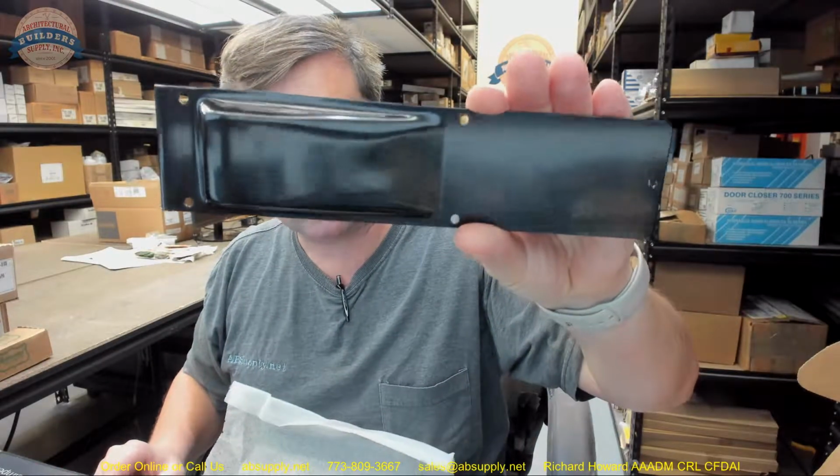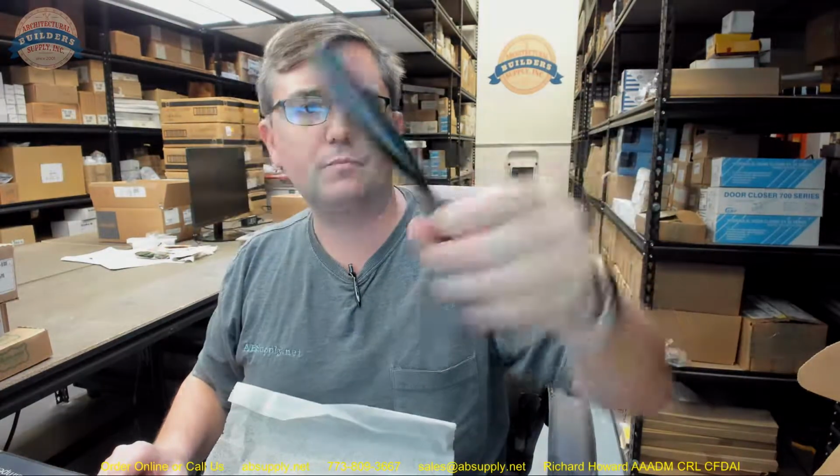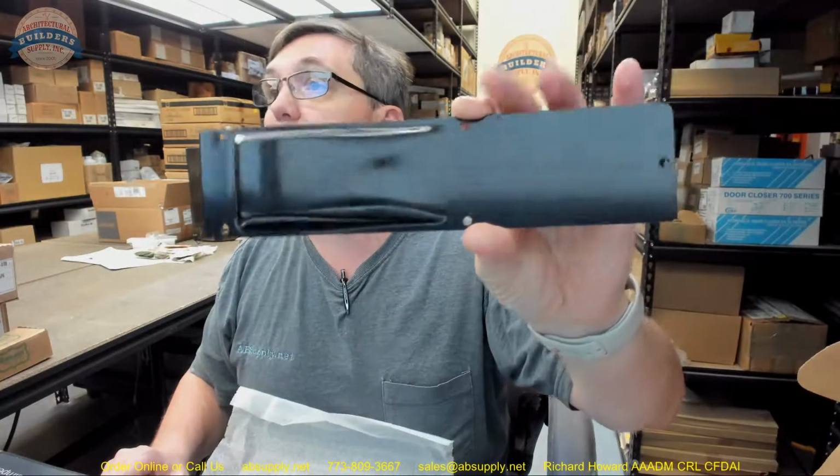Okay. Now the 7801 is available in lots of finishes. It's made of steel, so they can plate practically anything onto it. A lot of finishes. Prime Coat, Bright Black Japan, which is this. This is what black looks like. Black is a very popular color nowadays in the world of architectural and residential hardware. Zinc, which would be a reflective chrome color. If you're looking for something shiny chrome, zinc would be good because it'll be less expensive than polished chrome, but not nearly as refined.